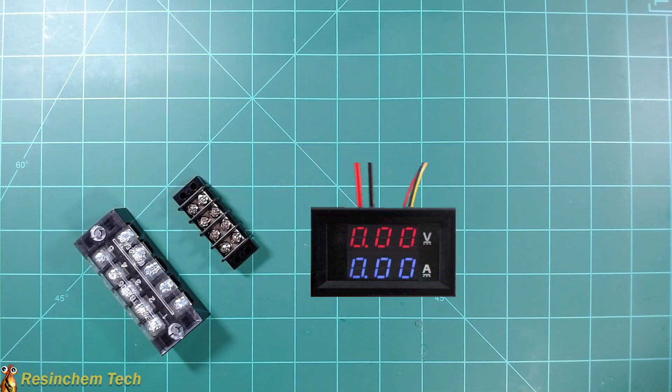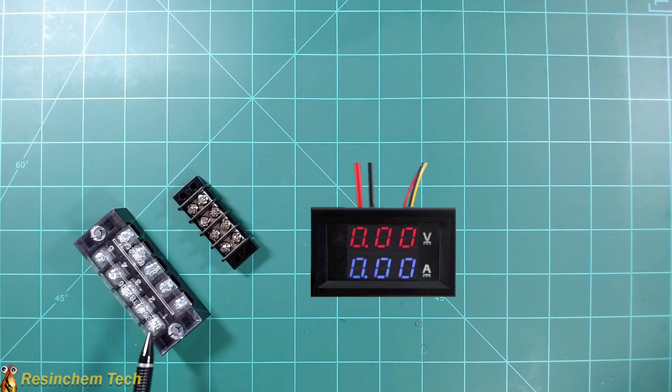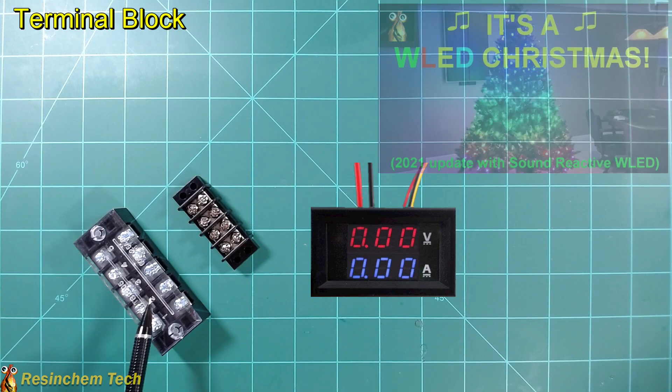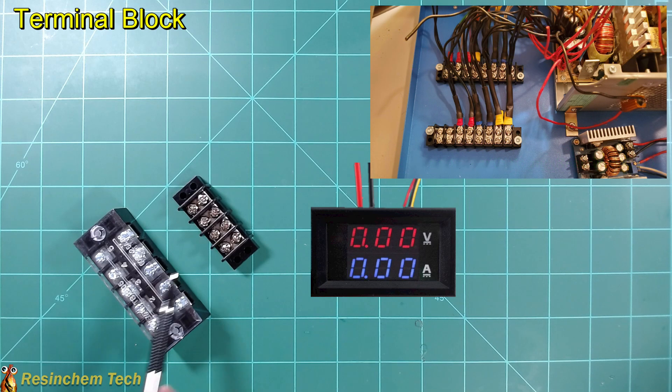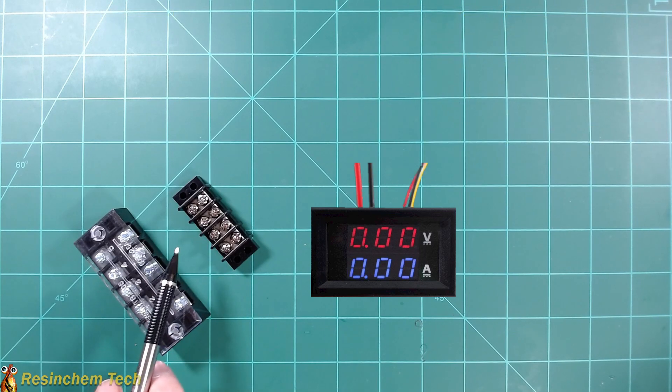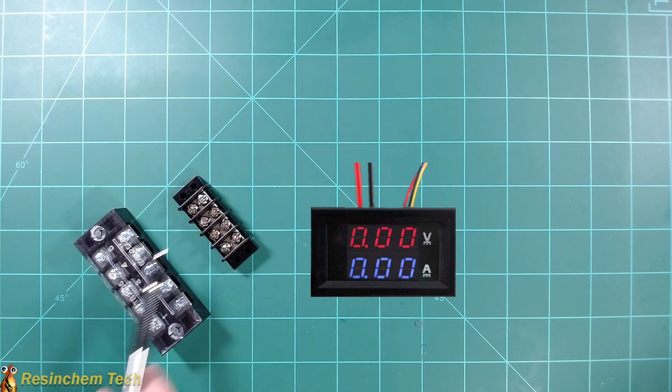There are a lot of parts I used for the first time in my Build Your Own Desktop Power Supply project, but there were a couple of items I've since used in other projects. The first is a really simple one: these terminal blocks. I actually first used these in my WLED Christmas tree project, but I made substantial use of them in the desktop power supply. You're not going to use these in smaller DIY projects, but for bigger projects where you have some pretty heavy gauge wire, they help not only in organization but in making good secure connections using something like a spade connector.